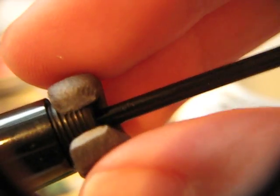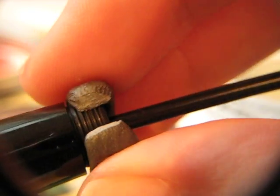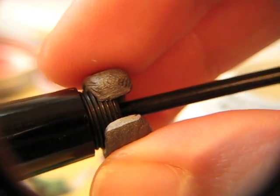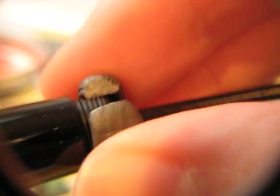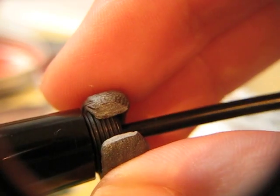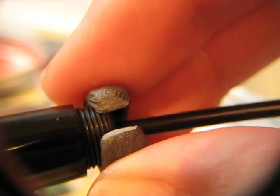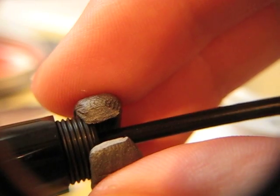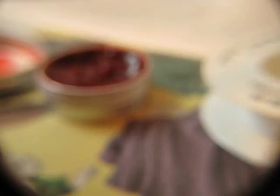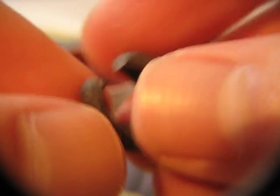I've got another hunch — basically those are rubber threads, it's a hard rubber boss in there, so it's not metal. It's too fragile to try and clamp with something with rubber around it — I wouldn't want to go for that. So it screws on and off okay. I should really have wrapped Teflon around that shaft, although it's just a shut-off shaft, it's better practice to protect it.